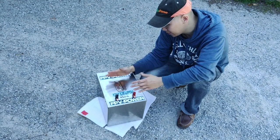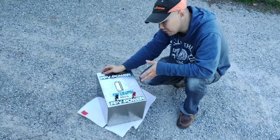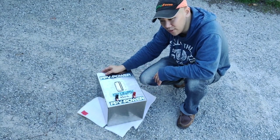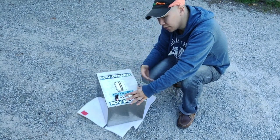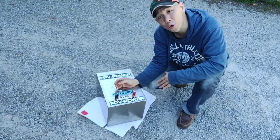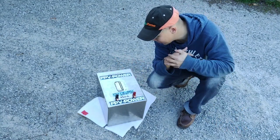So with that and this size 450, it should give him pretty close to unlimited power if he gets enough sun during the day. And if he does need more in the future, he can go double, 900 amp hour. But look, he's already surviving with his 440 lead acid, which is effectively 220, with his solar panel setup and everything.